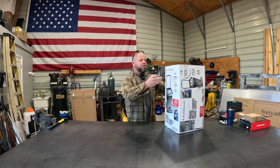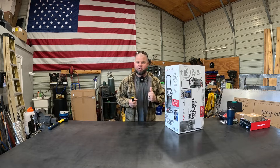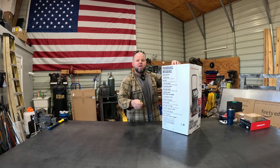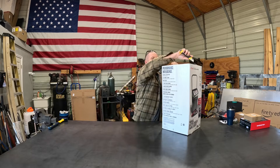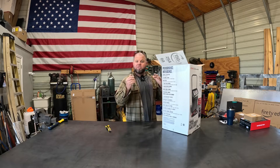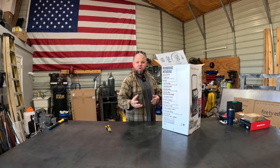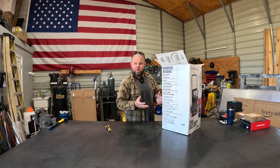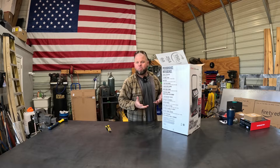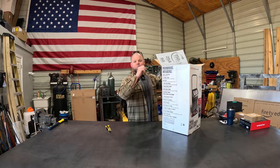This should be a relatively quick video. It's frosty and cold here today. I actually have one of those old batteries that my old charger would not charge years ago. It doesn't hold too good of a charge anymore and drops below 12 volts. I use that battery to run my shop diesel heater. When it ignites the glow plug, there's a heavy current draw and the battery drops below the diesel heater's minimum voltage and it cuts off. I can hook up this charger to get past the initial glow plug phase, and then my battery will run for hours just running the fan and the little fuel pump.